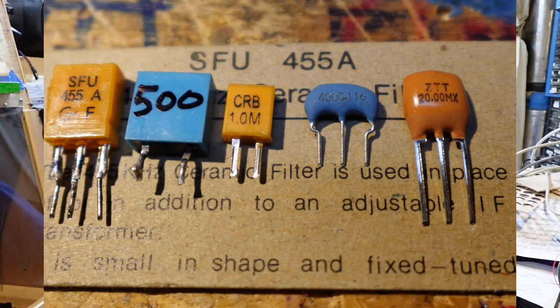I built those too. A 386 that amplifies the hell out of the Electret mic, the FET microphone. And then that goes through a choke, and then that goes to the emitter of a crystal oscillator. Now you can pick the frequency. Of course, if you want to hit on the AM band, you have to find a crystal in that band, or find a crystal or a resonator that will hit the band, or a harmonic of those crystals will hit the AM band.